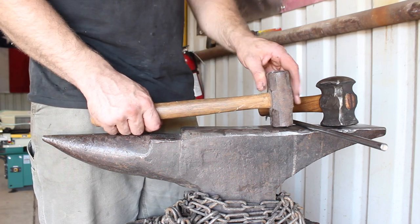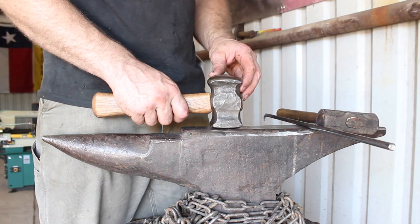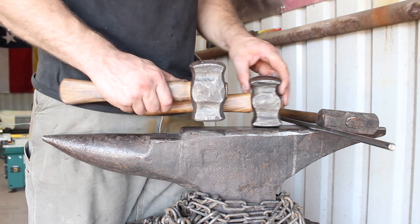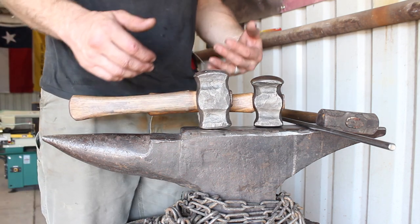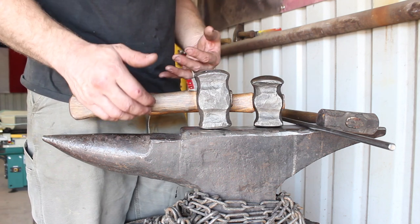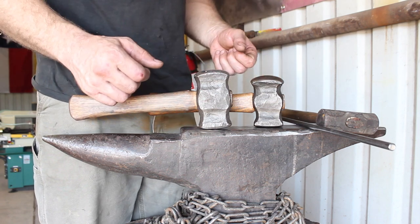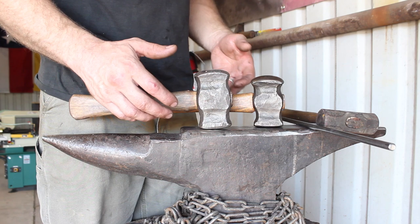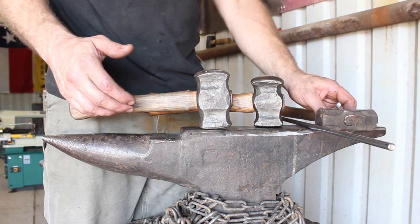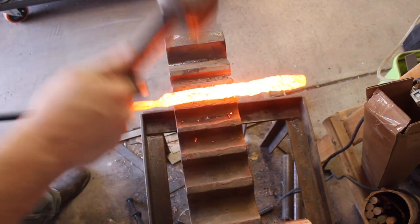This hammer is four and a half pounds. I typically use a five-and-a-half-pound hammer for most of my forging. These are weights you're not going to start out with, but as you work up in your forging career you will notice that you need a bigger hammer to get work done more efficiently, rather than hitting the steel harder with a lighter hammer. All these design features together allow you to use a heavier hammer more efficiently without sacrificing ergonomics and comfort during forging.